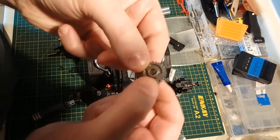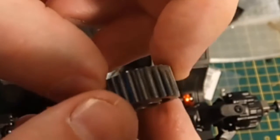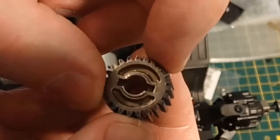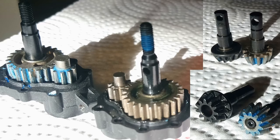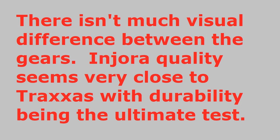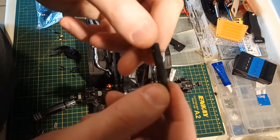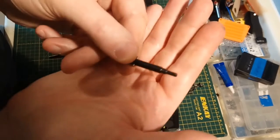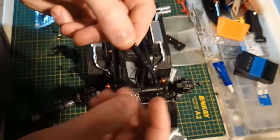There's the big gear. This also looks cast or sintered. They look good though - these look like nice quality gears. They're probably not absolute top of the line, but they look pretty good. I don't see signs of machining on the teeth, so they don't look like cut gears to me. But cast and hardened, they should be pretty durable. The shaft looks just fine - it's got a nice solid pin and fits in the gear really nicely. No reason to question the quality there.